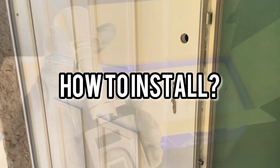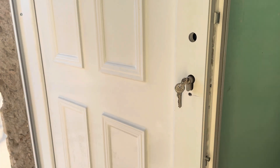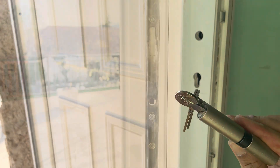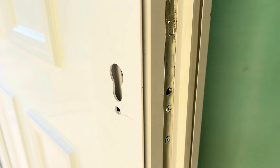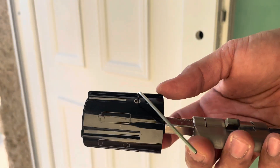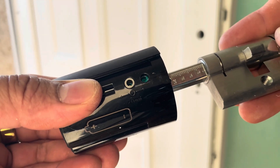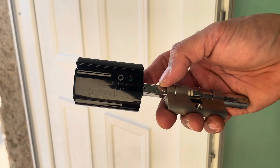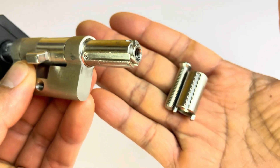So how to install this — check this out. Forgive me, this door lock is not yet fully fixed; I will just show where the WeLock device is to be installed. First you need to remove the screw that connects the lock, then turn the lock key a little bit so you can remove the cylinder. The thickness of the door is a bit wider so you need to adjust the length of the front doorknob. WeLock Smart Lock has 20mm adjustable handle distances on front and rear, easily fitting door thicknesses from 30mm to 70mm.